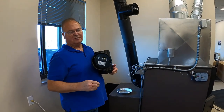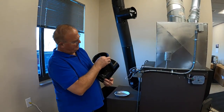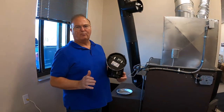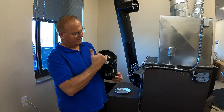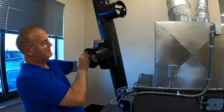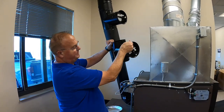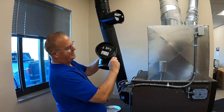If you have a two-story house, you're probably going to have a 25 to 35-foot chimney, and you'll most likely have to set this on number three — there's just a little slash mark between the two and the four. If you have a one-story ranch-style house, you'll probably set it on number four. You measure that on the left edge of the little silver knob. When you install this, you rotate it and use a level until the snout is level, then rotate the flap until it's level to the ground, and lock it in place with the screws.